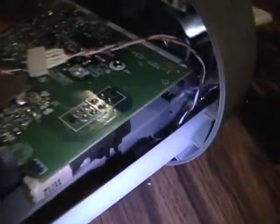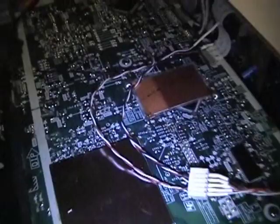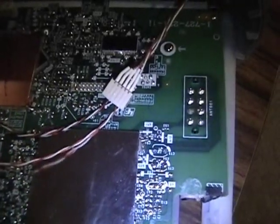Got the connector installed — I think I'm basically done. The auxiliary jack is right there. I drilled a 7/32nd inch hole to put it through and still had to file that a little bit to get it to fit. I tucked it in; it's pretty much opposite from the headphone jack. Here's the wires coming up to a disconnect in case I want to remove the board later — I didn't really need that, but I didn't want to commit to soldering and desoldering in case I had to undo it. Black's the ground, and I've got red and white for right and left going to the amp, and red and white coming from the tuner circuit.